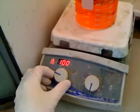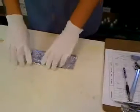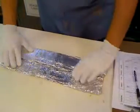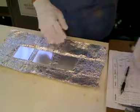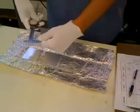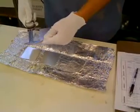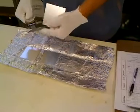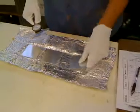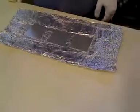After we've dried the coupons in the oven for the appropriate amount of time, we're going to measure the dimensions. Tyler has already done this here, showing you exactly the type of dimensions you're looking for: length, width, and thickness of the test coupons. Make sure you get those dimensions, which will help you in determining your surface area, and you want to make sure you record those.